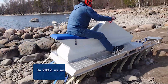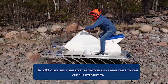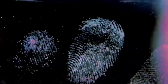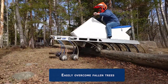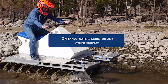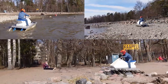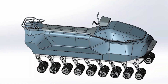Three: reliability. This 18-wheel all-terrain vehicle will continue to operate even if one or two of the 18 wheels fail — it will not even be noticeable in its overall performance. Four: absence of transmission, usually the most technically complex, heavy, and expensive unit in the vehicle, greatly reduces the cost of production, facilitates repair and maintenance, reduces weight, and, most importantly, makes the design much more reliable.